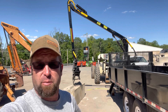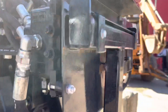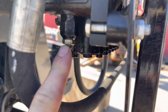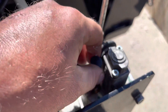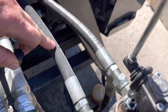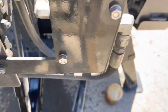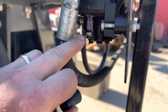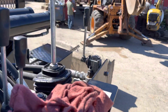We're going to pick this up with the AM190 from AM Machines. I'm on the passenger side of the controls. I was always told this is the main relief valve for the whole system. But what we found out on these dump trailers, at the dump controls, that's your main relief valve because this is your pressure coming in from the pump — that's your pressure going into the dump cylinder. This is your pass-through that goes completely around to the other side. So you can turn this relief valve up all you want, but it's not going to do a thing because you're limited by the one that's over there.